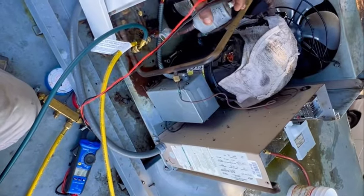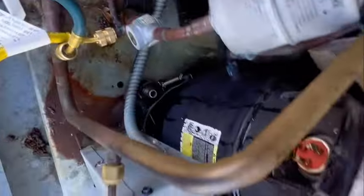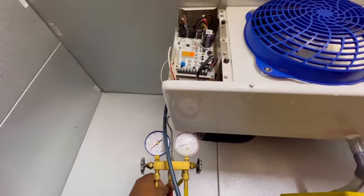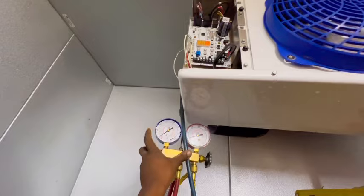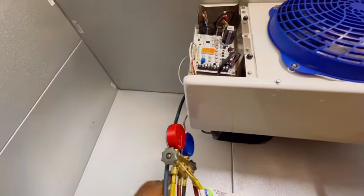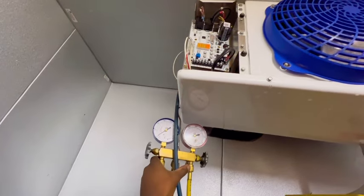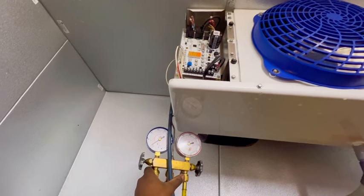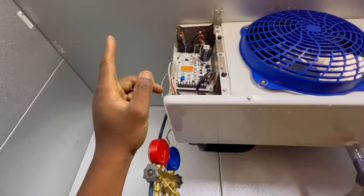For some reason my compressor had overheated so I had to cool it down — the wind-in was open so it finally closed. I had to play with this valve. My suction pressure was sitting at 50, but I adjusted the valve and it's feeding now for the first time compared to what it was doing before. I got a defrost going — I'm gonna let it give time to settle and make sure my unit up there has kicked off.